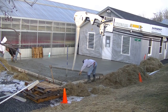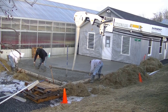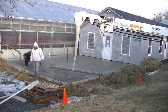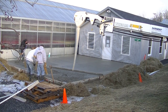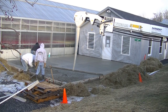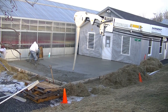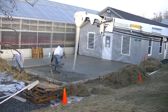You can see I'm setting those rebars in right on the edge around the corner, just pushing them down with my mag float, and then magging the edge smooth. We always like to mag the edge smooth with the mag float so it gives us a nice smooth surface to screed off from, and it helps make it easier to finish later — whether by hand or with a power trowel.